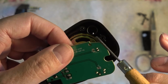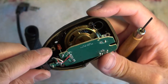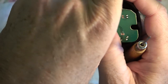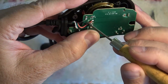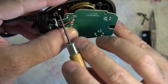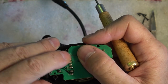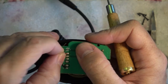Go get yourself a rubber grommet that fits around the microphone element but snugly fits inside this well. Since we don't have that right now, we're going to use what we do have that comes with the microphone. Also pay attention here — they do skimp a little bit on their time when they're putting these together. These right here happen to be the remainder of the LED solder terminals. It's probably not a good idea to leave loose wires floating around in your microphone, and they certainly have done that. So what we're going to do is pull these little pieces of metal up, twist them back and forth until they fall off, because it's not a good idea to leave bare wires floating around inside a circuit board. Bad practice — we're going to break them off and toss them.